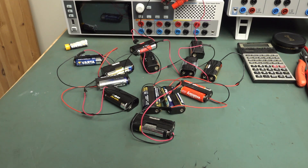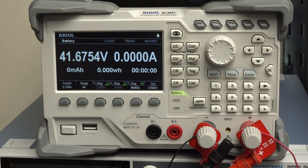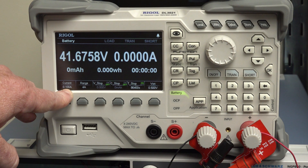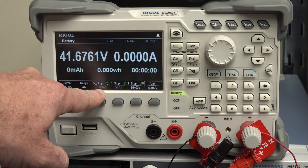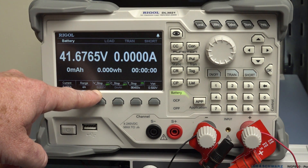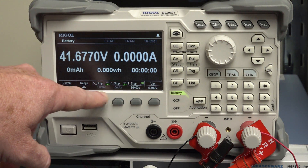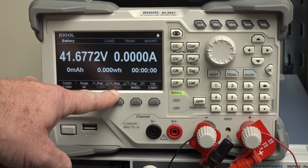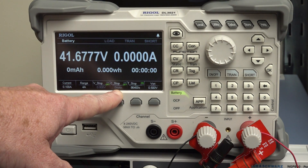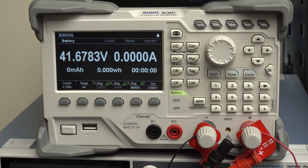So that's the plan. I've got it hooked up to my electronic load here and I'm about to run a 24-hour test. I've set it to 0.1 amps — 100 milliamps. For voltage stop, I'm not going to stop on voltage, so if any of these happen to go reverse voltage I'll just have to live with it. The time stop is 86,400 seconds — 24 hours.